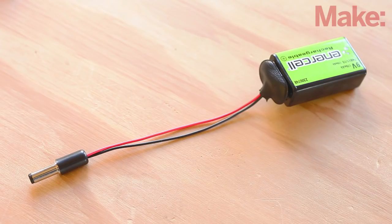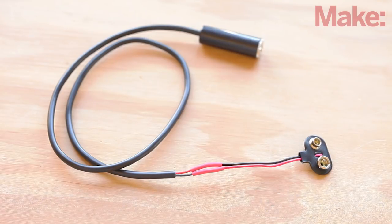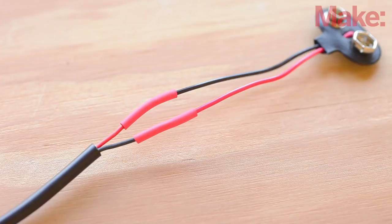Our bass amp can run off the internal 9-volt battery, so we need to make a cable that connects that battery to the power input jack. Solder the red wire of the battery clip to the center contact of the coaxial plug and the black wire to the outer contact. The internal 9-volt battery can be recharged from a standard 9-volt battery charger, but because it can't easily be removed from the case, we'll recharge it through the plug soldered to its battery clip. Make a charger cable by using a leftover piece of headphone cable and soldering a power jack to one end and a battery snap connector to the other. Because we'll be using two battery snaps to make this connection, we need to solder black to red and red to black on the second battery snap connector to maintain proper polarity.